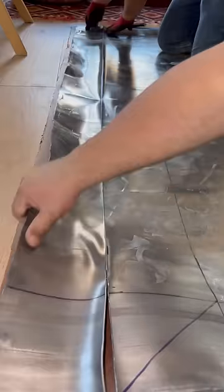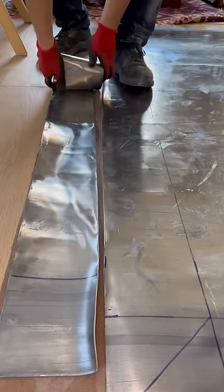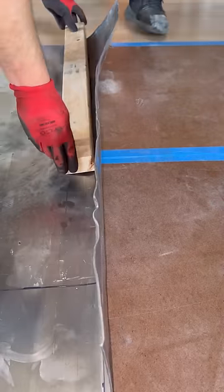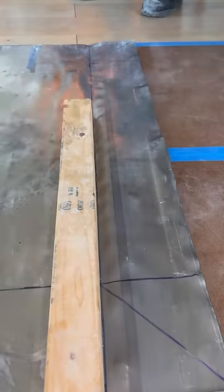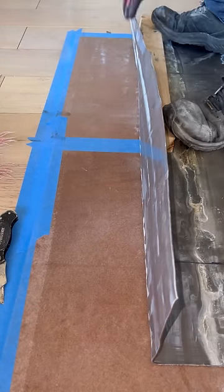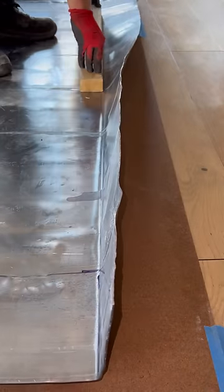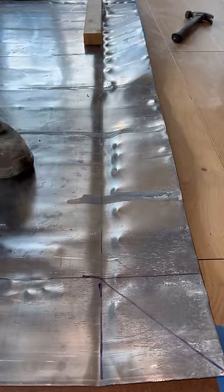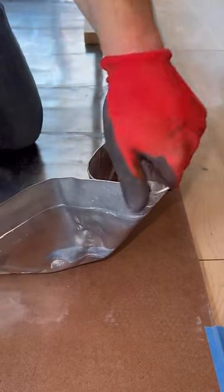The bending process of the corners is where the expertise is most needed. In order to get that perfect corner, I have to mark the diagonal as a guideline and bend it slowly while raising the sides. Once I have a good-looking corner, I take two pieces of 2x4s and straighten out the sides by using a hammer. When the overall shape looks like the perfect rectangle, I start bending the corners into place because they have to be aligned a certain way in order for the pan to fit into place perfectly.